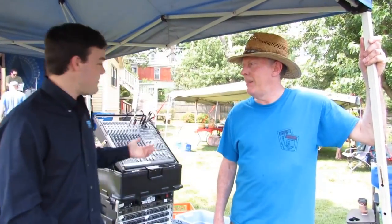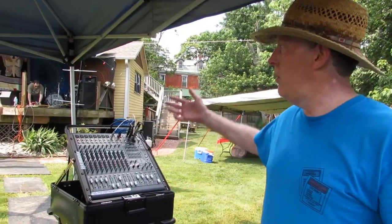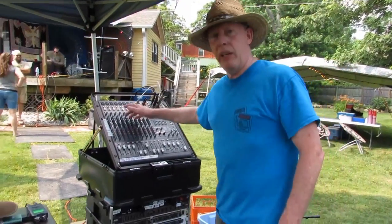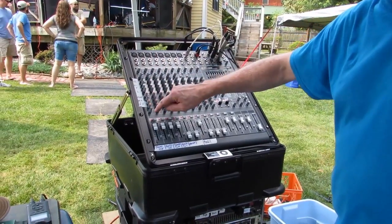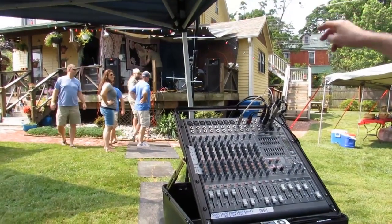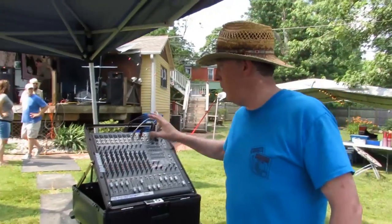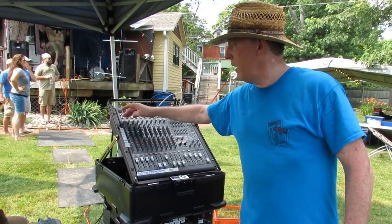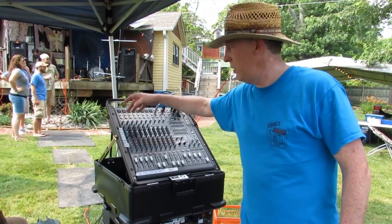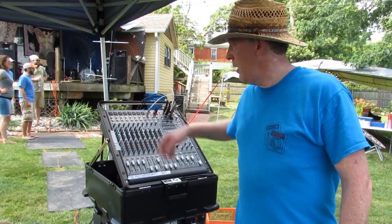I'm here with Tom Worthington, our audio guy. One of the most important tips about live streaming a concert, a band, a church, or even sports is to make friends with the audio guy. Tom explains: his job is to give the video guy a good feed and to make the band louder. He brings each signal source into the mixer through individual strips and faders that control volume. The signal goes out to an amplifier on stage and to the speakers, with two stereo outputs going over to the video. The most important thing about doing sound, besides having good music, is the right amount of gain into the board — if the gain isn't high enough, you're just amplifying noise. You want to be as strong as possible without distorting.